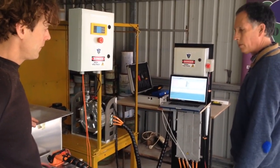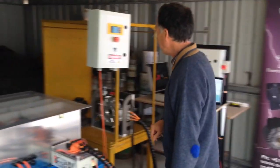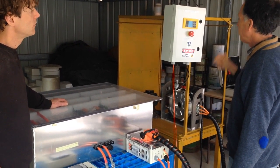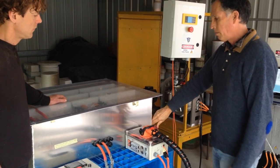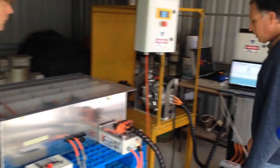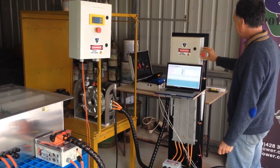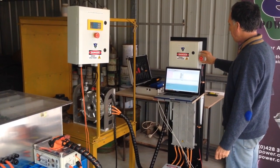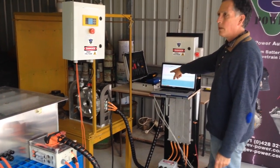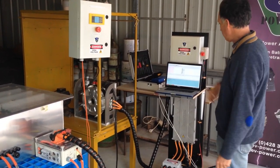I've got a noisy 24 volt power supply in the background just to power up the logic. The first thing we do is turn on our insulation monitoring unit, and then we can power up our main power. So far, no smoke and flames — very good. Now we power up our ECU, and you can see straight away it's starting — the controller and the inverter start to talk. It's starting to talk on the CAN bus and send through messages.